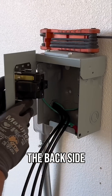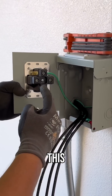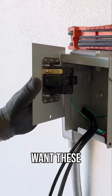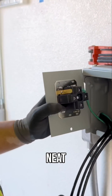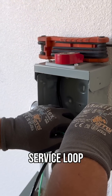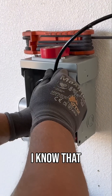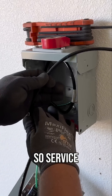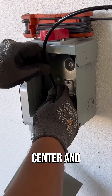On the back side, this is black, this is white, and this is red. Black, white, red. So I want these wires lined up nice and neat. I like to do one big service loop in there, and then I know that the neutral is going to be dead center. Service loop and then dead center.